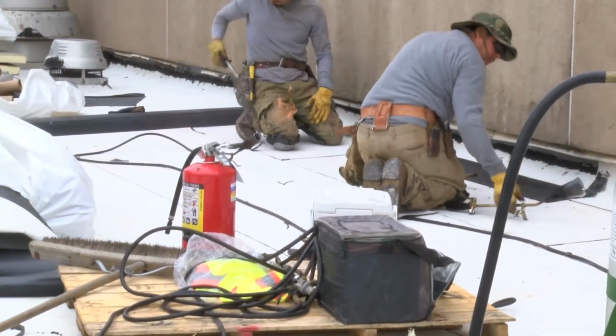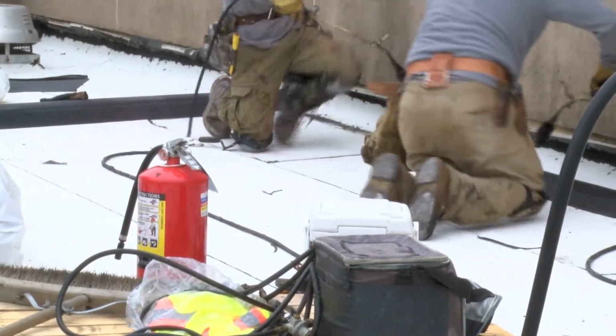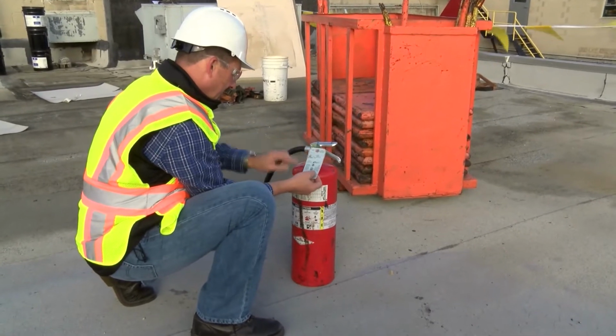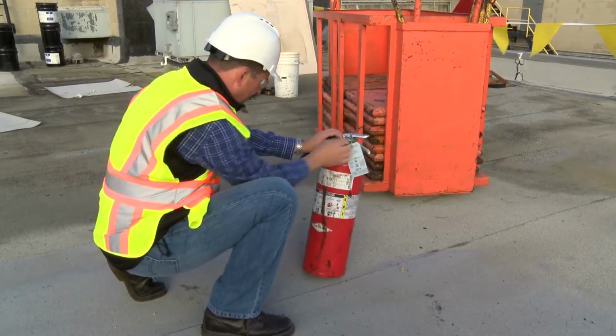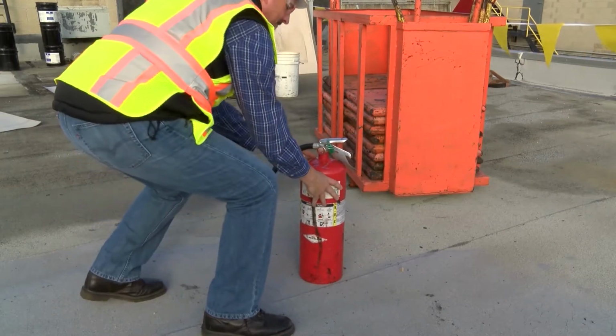And fire extinguishers must be readily accessible with no obstacles blocking the path to reach one. Fire extinguishers must be checked each day of use to make sure the indicator is in the operable range and they have no physical damage. Defective, rechargeable extinguishers must be taken out of service and recharged, following the correct procedures.